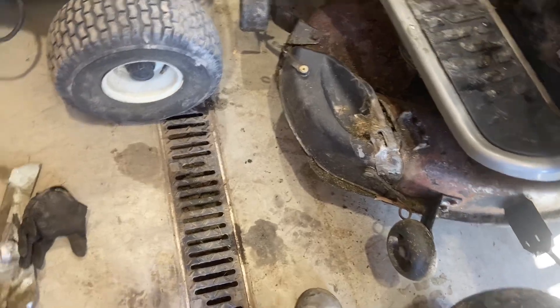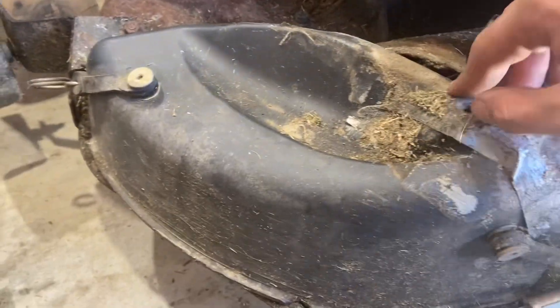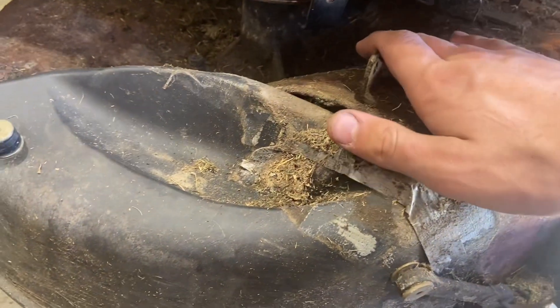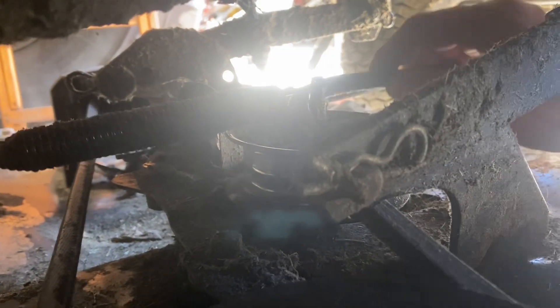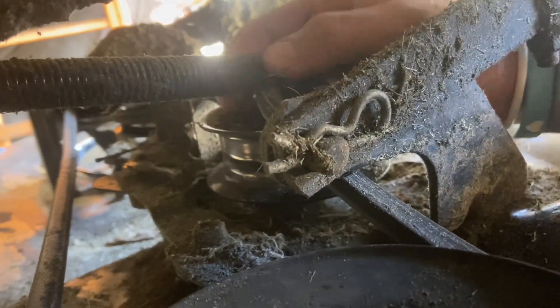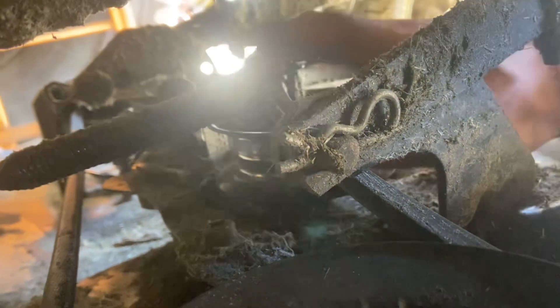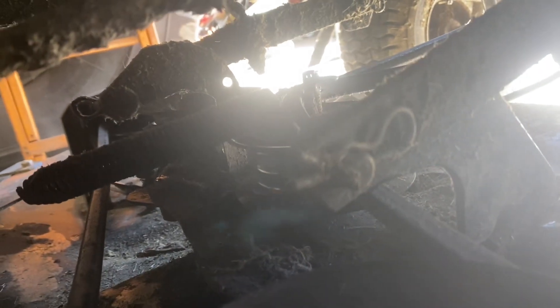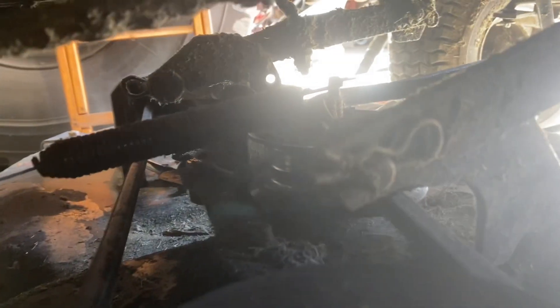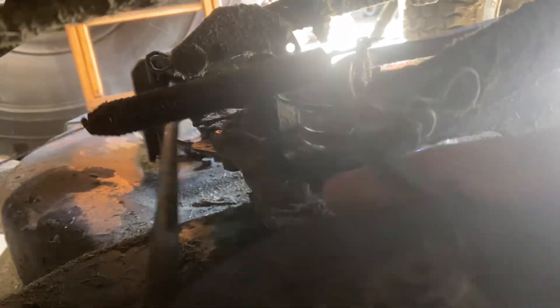I think I already found the issue. There was a bunch of duct tape on here, and the plastic chute piece ripped off. I have another one around back. The problem is it's going to be pretty hard to see, but if you can see this belt here, it's supposed to be around this pulley. It goes through this spring, so I just have to pop it around the pulley and that should work. Whenever I go to engage it, it's not getting any play, so I'm just going to pop it right around this pulley.